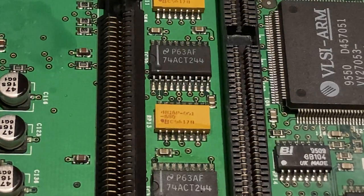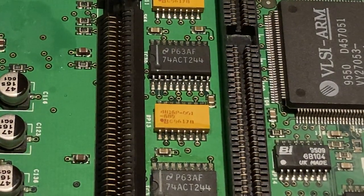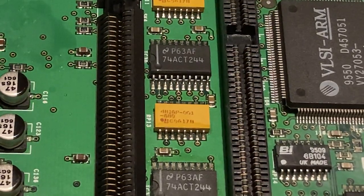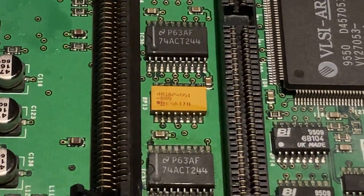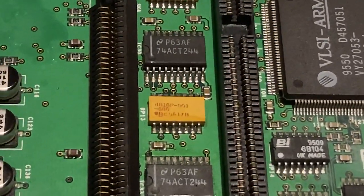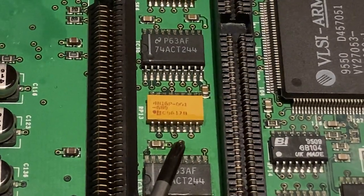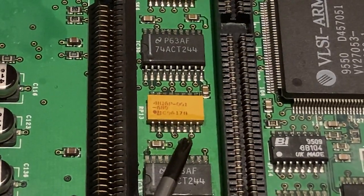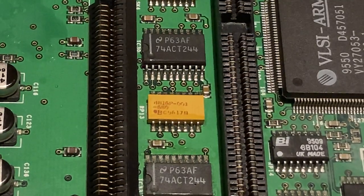And you can see that that's very thin. I reckon the trace is probably about 1/2 mil, maybe 1/4 mil wide. It's very narrow and it's just a thin layer of copper. When the battery leaks, the alkaline that comes out of it eats away at the copper, and you can end up losing everything. You know, the ring may disappear, or that thin connection there may be eaten away completely.